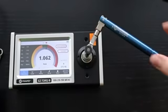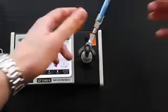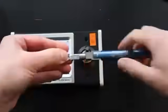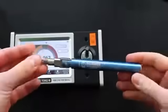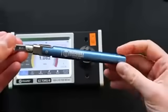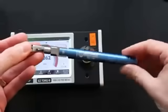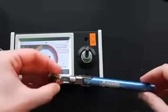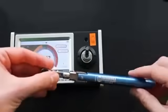Due to their mechanisms, breakover wrenches, just like the click wrenches, are also length dependent. So that's why we deliver those tools with a groove here to clearly indicate where the tools need to be held for the fastening operations.